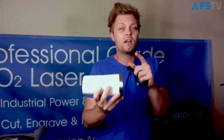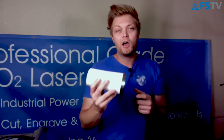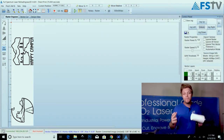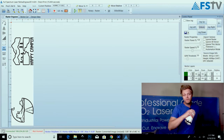The chuck rotary is going to hold it with the chuck clamps and it's very nice for metal pieces like this. Our tumbler is coated with powder coat and we're going to remove the powder coat with our CO2 laser at 90 watts, 100% power, 50 speed. We have a design by Megan — she has an Instagram called Megs Designs, that's Megs with two S's — she's a graphic designer in St. George. We're going to do two of her designs on this cup. When doing a cylindrical object with the chuck rotary, you need to measure the diameter and put it into the software once you select and enable the rotary.